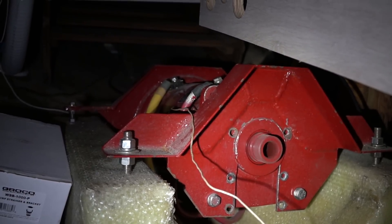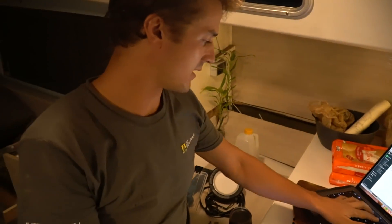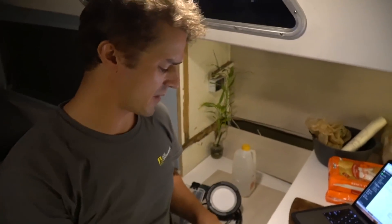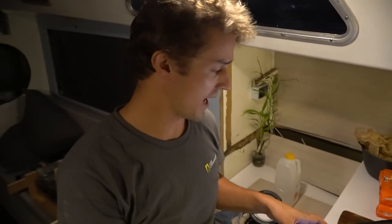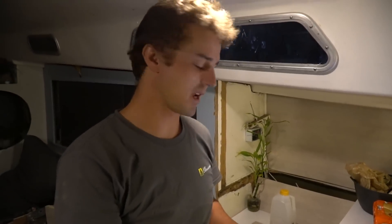It's been an hour — let's look at the numbers. The batteries are at 75%, so we used 25% in one hour, which means we can motor for three hours at four and a half to five knots. That's really good and will only drain us 75%. The time-remaining display on the app doesn't seem accurate — it said one hour left after only using 25%, which doesn't make sense.